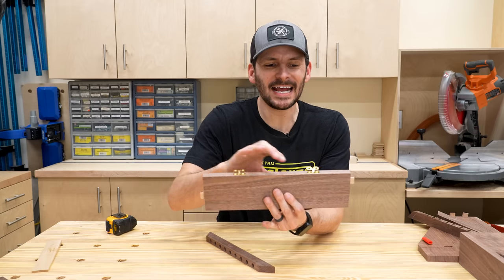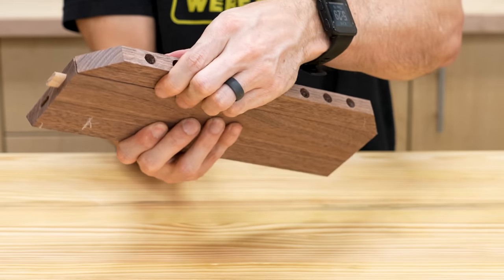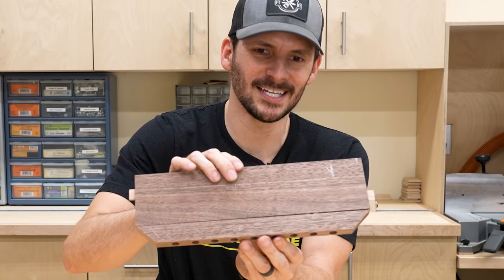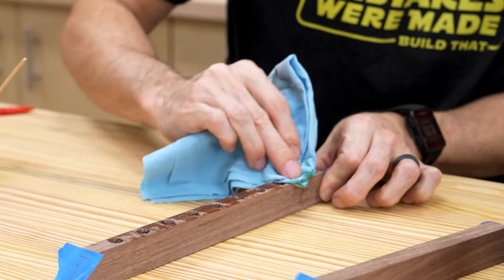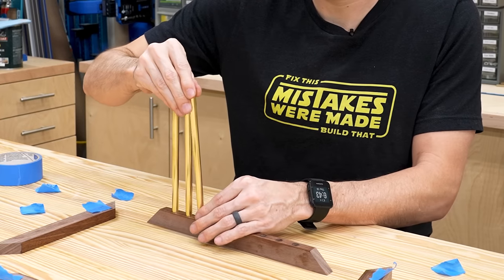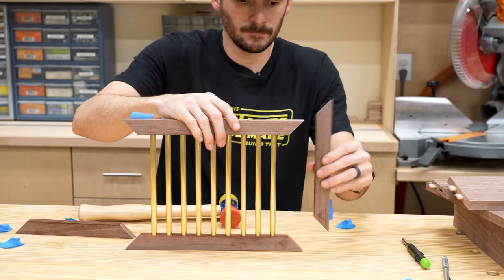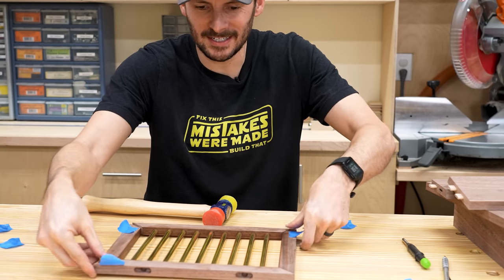I got the hinges in there and they turned out pretty good — some little gaps here and there. With the top put on, you can just open the front. How cool is that? These invisible hinges are pretty neat. I went ahead and put some finish on the inside of this door before I put it together, because it will be nearly impossible once these bars are in here. I started stacking these in and seeing how it goes together, since I can't fold it up like I normally would — the top and bottom are going to be locked. Just a touch more. I think that will do it. Let's get some glue.